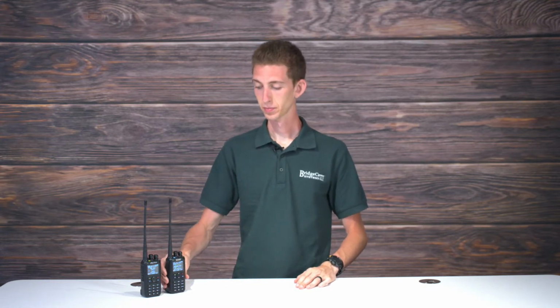Any more questions? Can you do DMR simplex? Great question. You can. DMR simplex works great. We'll have to cover that another time, but it's a very similar process. We've covered something similar before, but we could certainly do that more specifically again. You go in, you set your color code, time slot, frequency, everything like that, and then you save your channel.